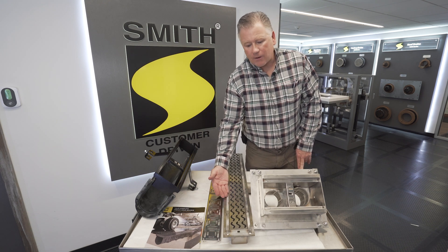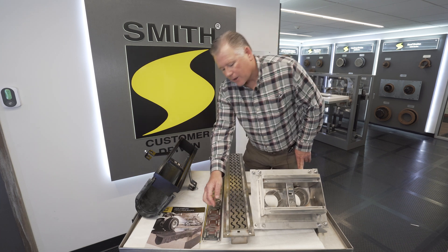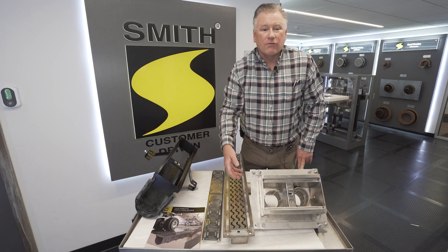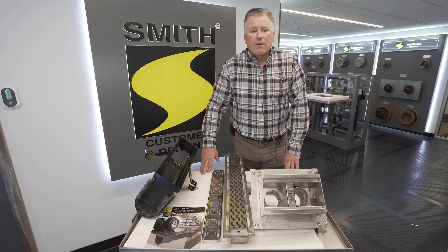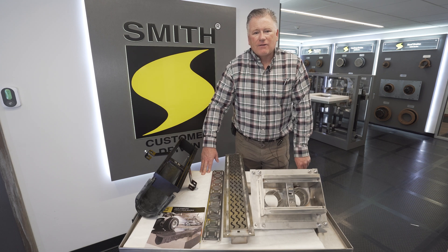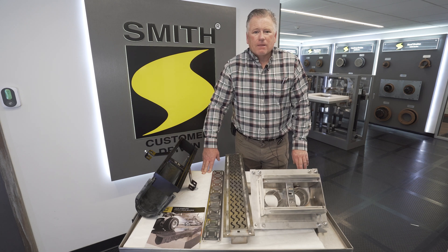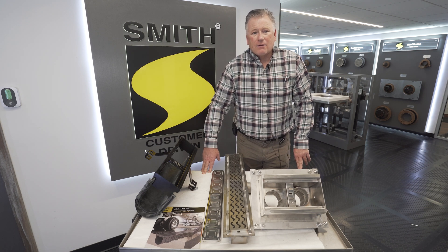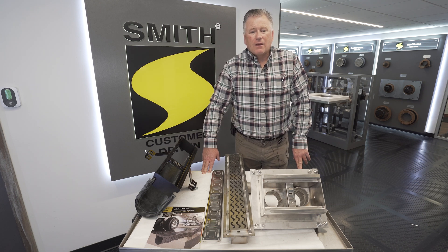If the concrete pulled up and separated a little bit, we'd be able to pick up that nuisance water with one of our weep holes right here, and it just goes into the trench drain out without hitting your lower floor levels. We have a lot of experience with pool applications on top floors and decking where we don't want water to migrate through and damage the lower floors.